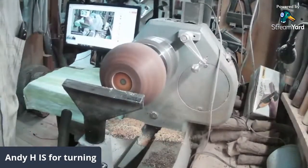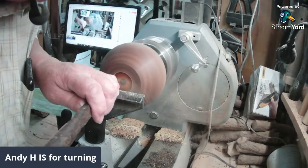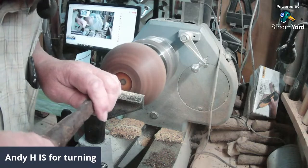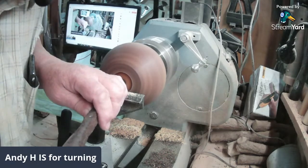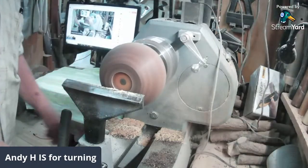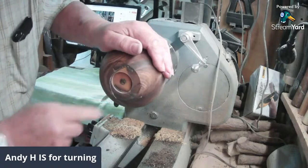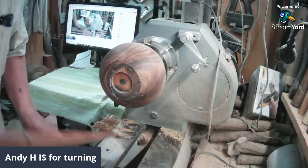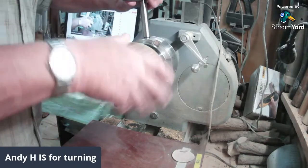Yeah, I'm in tendency to agree with you, Robbo, on that one. But with it being an ebony, Robbo suggested that he's got a tendency to squash filler plugs with pliers to put grooves in them so that the glue has somewhere to key to rather than wipe it out when you hammer it in. Oh, I see. Yeah, I have done that in the past, I must admit. But if I'm using a softer wood plug, I quite often just upend the skew and put a couple of grooves in it. And it's a valid point. If you've got a dowel that you need to put into a hole and you overturn the dowel or you overdrill the hole so that it's loose, if you put a couple three rings around it before you glue it in, you will get a tighter fit. Because it expands the wood. Oh, yes, of course it does.